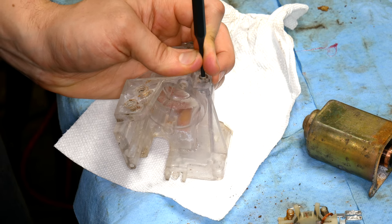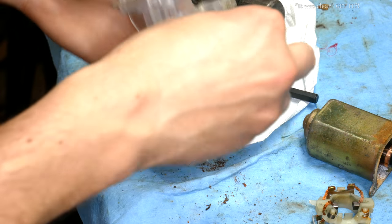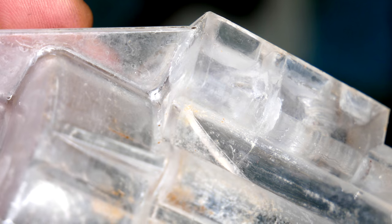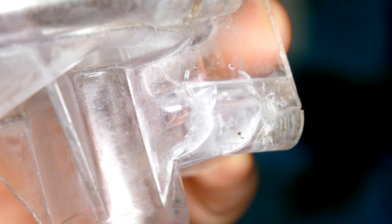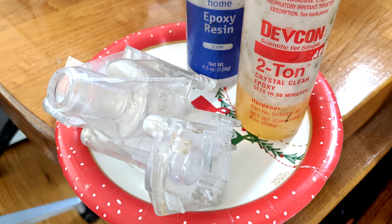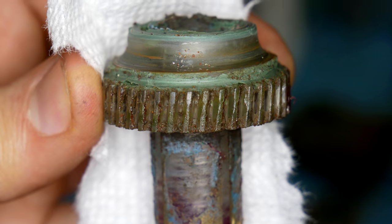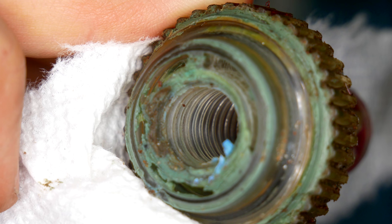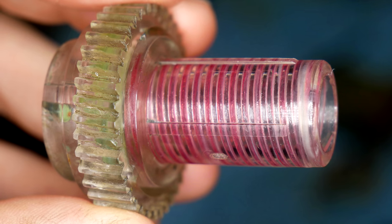Between the main gear and the gearbox was a spring washer - we'll keep track of that. We can unscrew the main gear from the link rod and remove the bearing, and that's almost everything. Carb cleaner and Scotch-Brite worked great for the steel link rod and its base plate, though not unexpectedly it did discolor the clear gearbox a little bit. Once it was clean, I could see there was actually one part left in the gearbox: a little pressed-in support bushing that holds the end of the motor shaft. We'll use a pin punch to knock it out so we can clean it up. Now that we could take a really good look at the housing, it was clear there wasn't just the one crack - in fact just about every screw hole and mounting boss on the gearbox was at least a little bit damaged. Surprisingly it was all still in one piece, so I decided to just go ahead and epoxy the outside of this thing. The main gear appears to be in very good shape - hideously filthy, but the teeth look good, so we'll clean it off with soap and water.